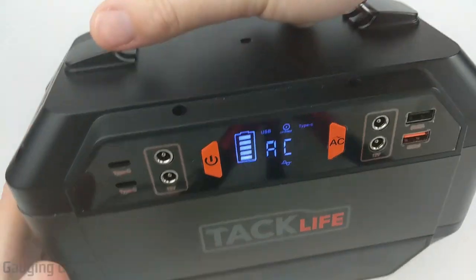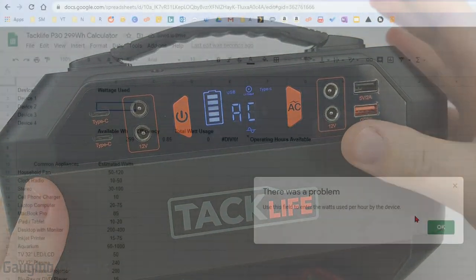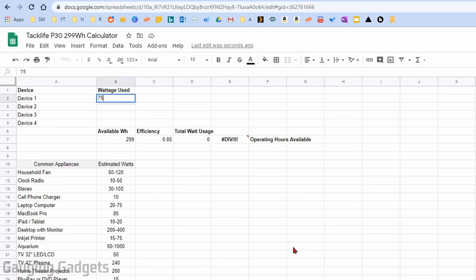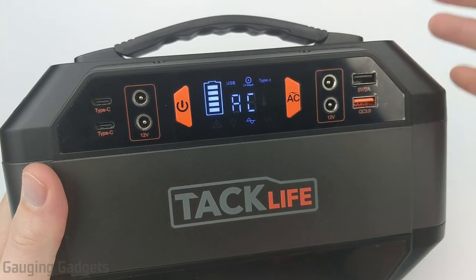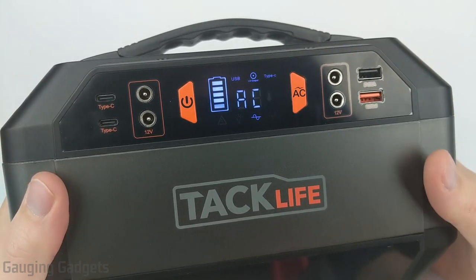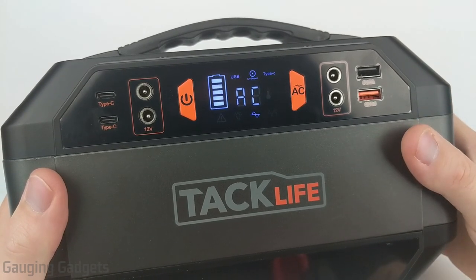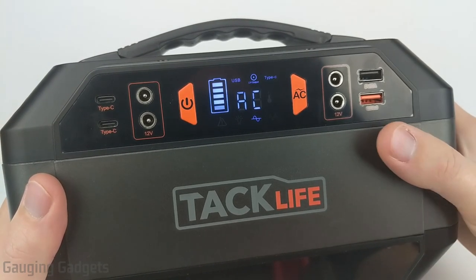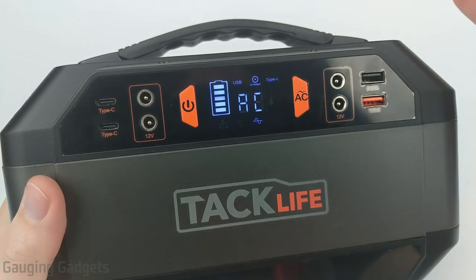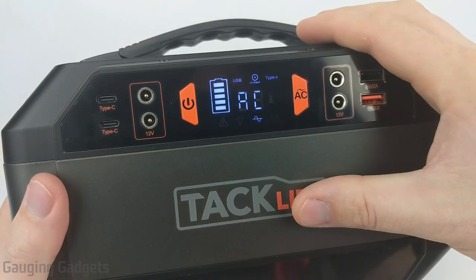The handle makes it extremely portable, and it's really not that heavy for the battery life it offers. If you're trying to figure out if your device can be powered by the TacLife P30, check the description — I've created a spreadsheet where you enter the watts your device uses and it estimates how long it can run. It also lists average usage for several household devices. I tried to plug in a mini fridge, and it wouldn't even turn on the AC inverter. That's because the P30 recognized the device was drawing too much energy and shut it down to protect its electronics — so it has solid overload protection.